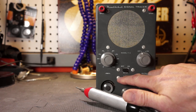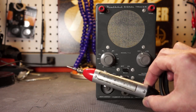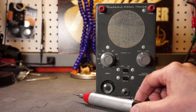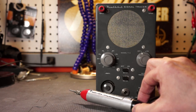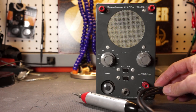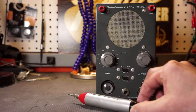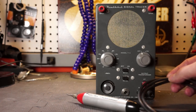The next switch is a noise switch, and I read that with this probe you can actually apply some amount of DC — roughly 100 volts — into an existing circuit, which may help to start isolating where in a circuit there's a problem. Being able to inject DC and maybe some noise would help you do that. When you do something like that, the device under test — whether it's a guitar amplifier or radio — has to be off, because now you're essentially applying power from an external device, kind of like using an external DC power supply.